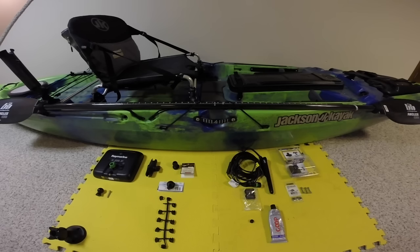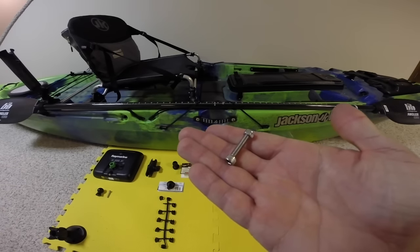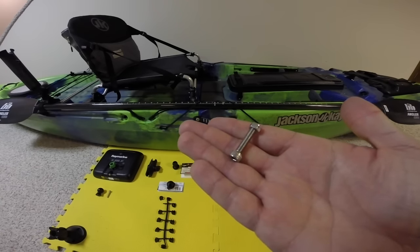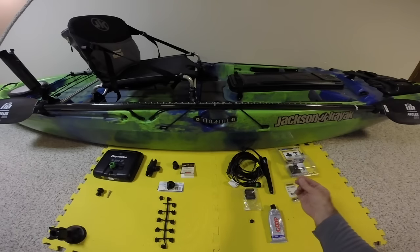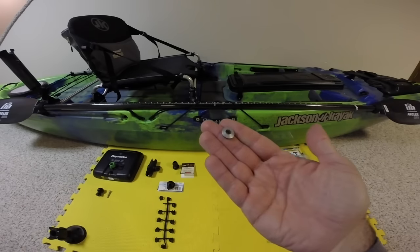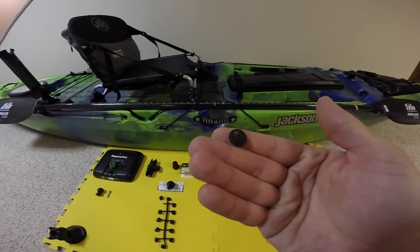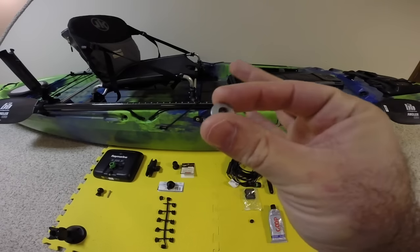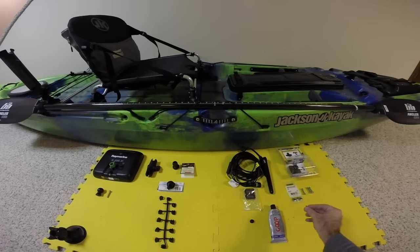To attach the stationary ball, I use five-millimeter screws with a lock nut. To make it watertight, I use these washers — rubber on one side and metal on the other — so that I can torque them down and get a nice watertight seal underneath. You'll see how that works in a little bit.